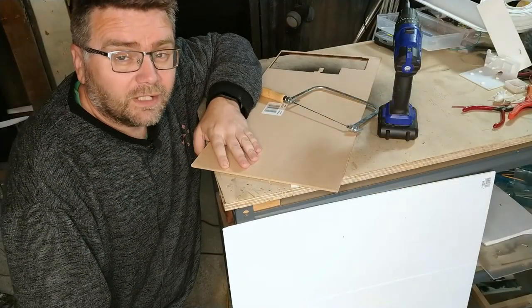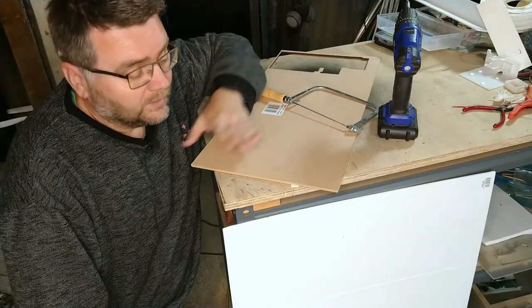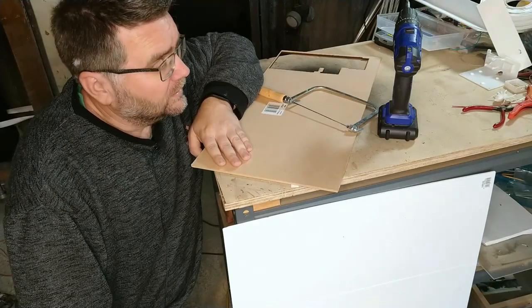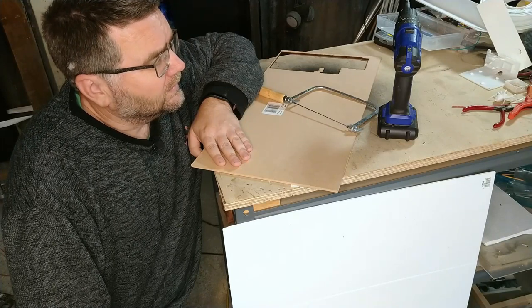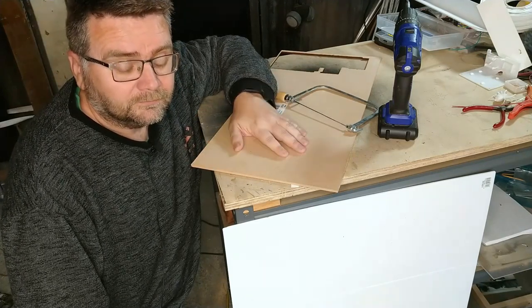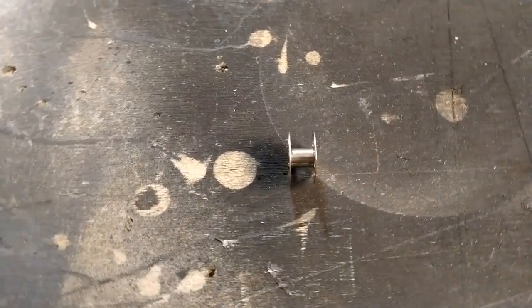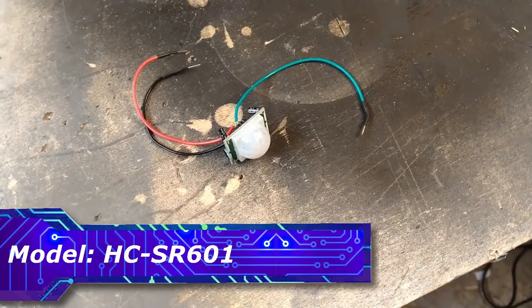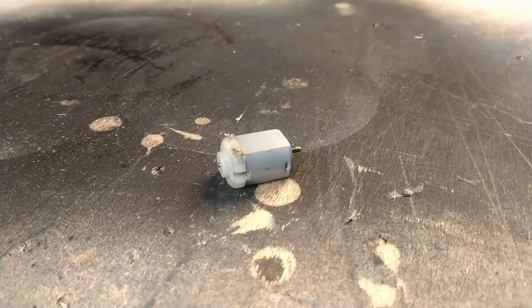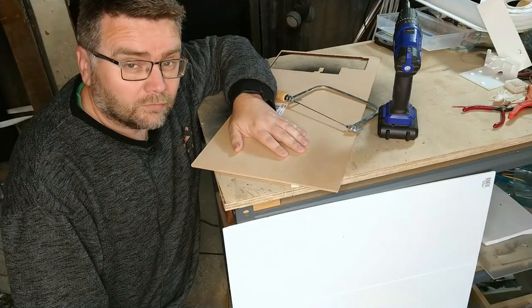Welcome to the wood version of the build. Not everybody has access to a 3D printer, so as long as you've got a drill, coping saw or hacksaw, and some 4.75 mm MDF, you should be able to build this. You'll also need 3 mm, 8 mm, and 10 mm drill bits. Along with those you'll need: large cable ties, a cotton spool for sewing machines, a micro switch, PIR sensor, motor controller, DC motor — from an old toothbrush — and an Arduino Uno.